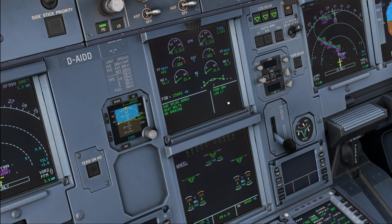Now, there is a second reason for the temperature limitation of 300 degrees for a takeoff, and that is what happens after the takeoff. I'm sure that many of you are familiar with Boeing aircraft that do not have a brake fan at all. Boeing philosophy, in case of hot brakes, is just to keep the landing gear extended in flight. However, that can become rather expensive rather quickly.